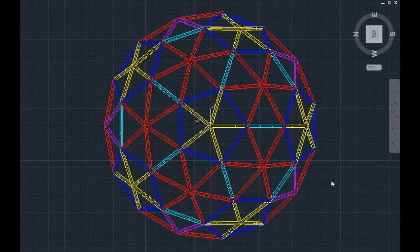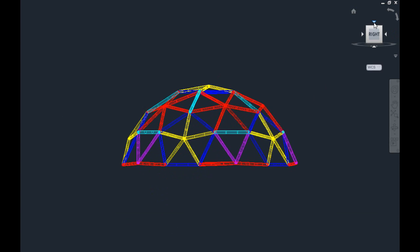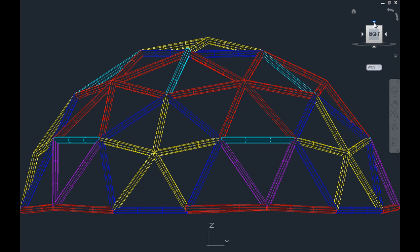Hello everyone, in this video I will discuss the hub design for this dome, and the next video in the series will detail the strut design. This is a 3V 3/8 dome, so it will require a total of 46 hubs consisting of 25 6-way, 6 5-way, and 15 4-way hubs that will be used along the base.